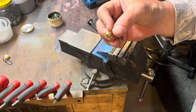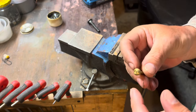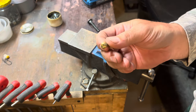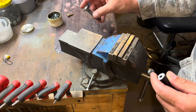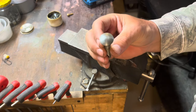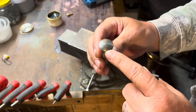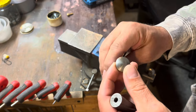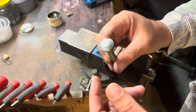You can buy special balls made of brass, special tools made of brass to use to crown a barrel. But you can also just go to your hardware store — and this is best for the bigger barrels — but you just take a carriage bolt, do a little bit of smoothing to get it nice and smooth, and it works perfect.